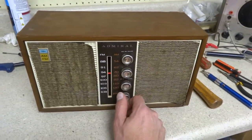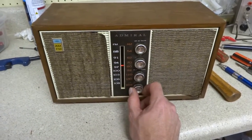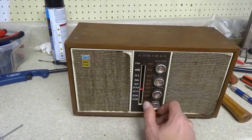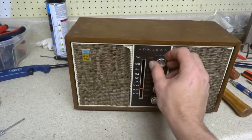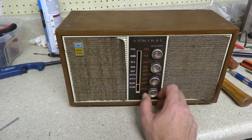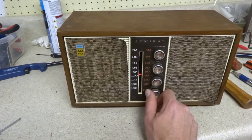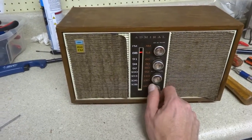I did not replace the filter capacitor. When I plugged it back in to check the dial, there was no more hum, so the only thing I can figure is the capacitor must have reformed. The radio obviously hadn't been played in quite a long time — the dial string wasn't working right. Basically the string just needed to be put back on the little wheels and tightened back up. Everything seems to be working okay now.